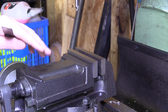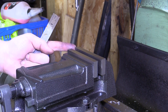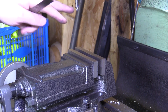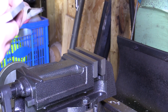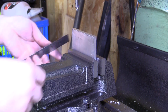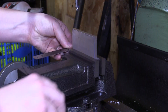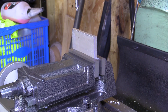I've got my machine vice set up. I've indicated this end of the jaws and that face, so that's where my zero is set up on that corner. I've centered my drill in the position where I'm going to be drilling all of the suspension arms. All we need to do now is use a straight edge, push them against that edge, tighten it up, and then we can drill it.